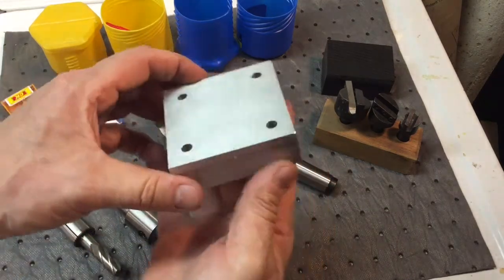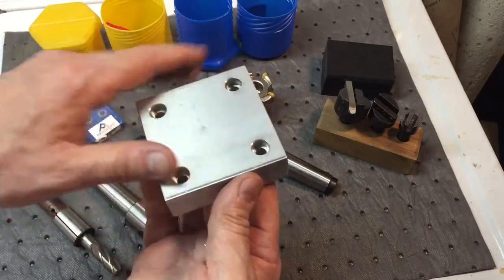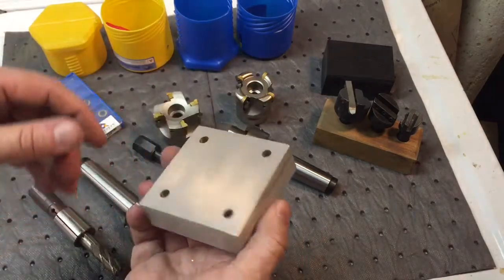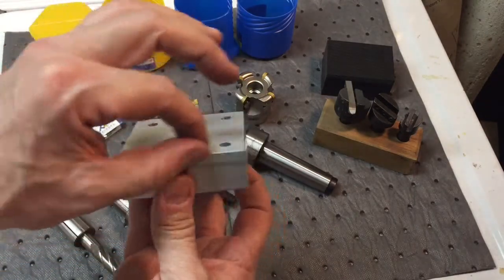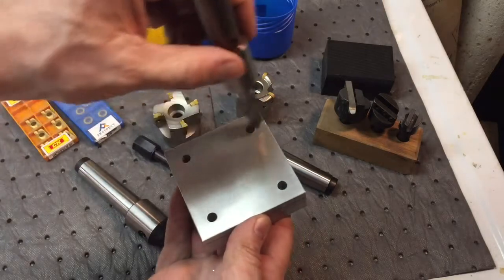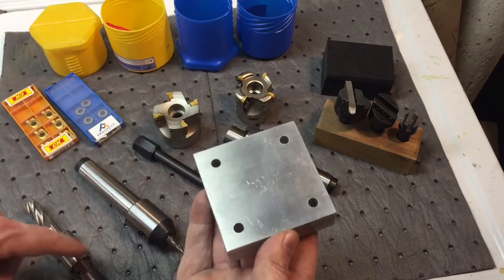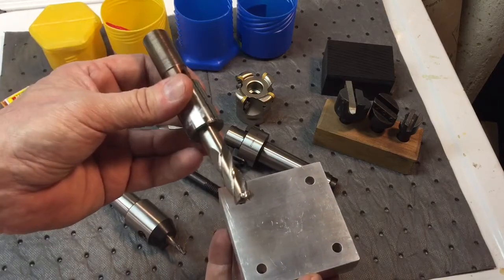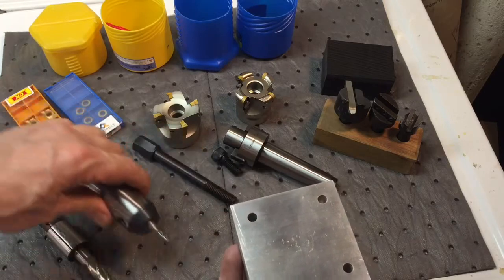What we use the milling machine for basically is to take the surface of an area — we could do all kinds of operations with flat stock, anything round stock as you would be doing on a lathe. But with this mill, if I wanted to take some of the stock, remove some of the stock from this area here, typically you could use an end mill. You can make a lot of passes back and forth, but that sometimes doesn't leave the most desired finish, though it's a little bit quicker in stock removal. Now there are different ways you can mount the end mill — you could use it in a collet, or you can use an end mill holder, which is made basically to hold end mills, and that goes into your milling machine.